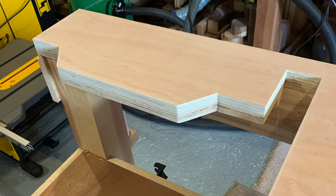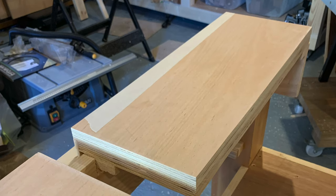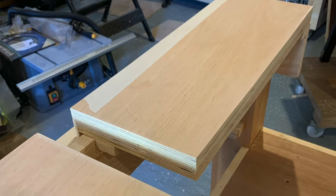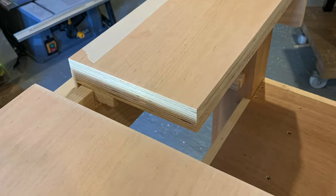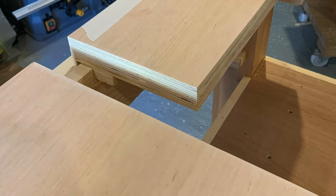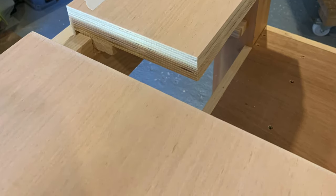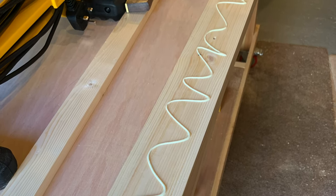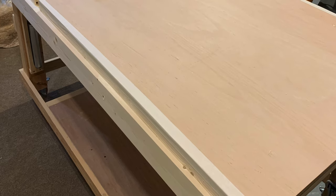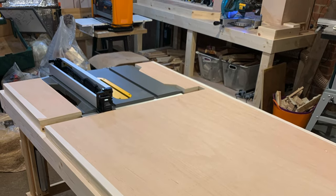I then tidied up the cuts with the electric sander. Now I've just remembered why I cut this straight on the right hand side — it's so you can get to the locking mechanism on the fence. When the fence is in position you want to lock it down, and there's a lever on the right hand side of this saw. For those of you that own this saw, you'll know exactly what I'm talking about. I then decided to put a nice chunky edge all the way round the bench. This was 4x2 that had been planed down a little bit through the thicknesser. This is thicker than it needed to be, but it was done on purpose because I wanted to put an edge in all the way round, and that acts as a shell for the edging.